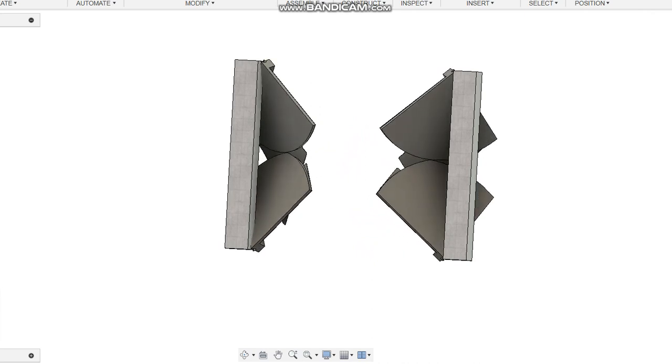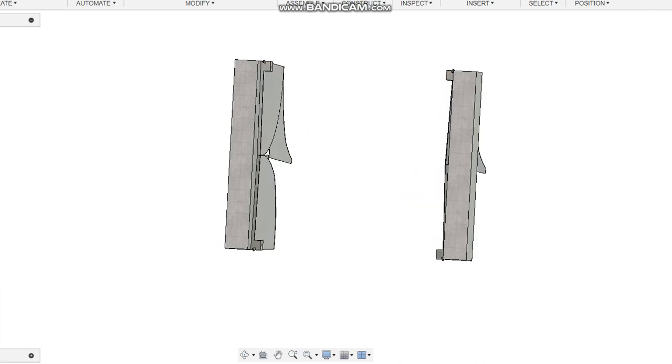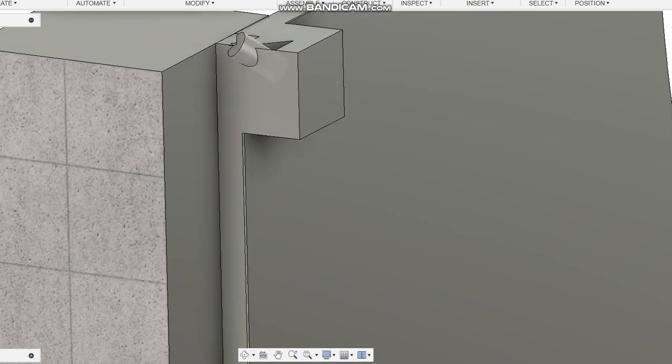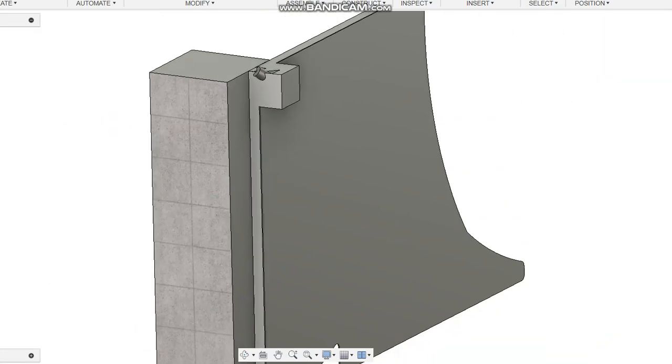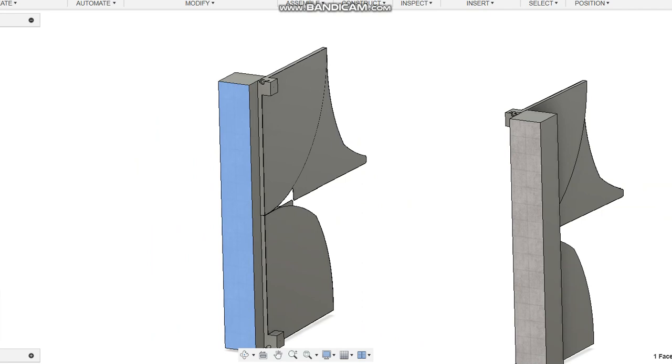So at the halfway point, of course, it's balanced. But then even on the opposite side, it's still balanced, which means I can still use standard gate hardware. It's $1,500 for a kit, solar panel, roll up, hit a button, and your gate opens. That's the same hardware I'm going to use on this. They won't need Genius Conrad to come out and fix their door whenever it breaks. It's just a regular door. It just looks crazy. I have to machine a pin at two 45-degree angles in order for this to work. But this bracketry is going to bolt to that stone that you told me you know the stonemason guy.